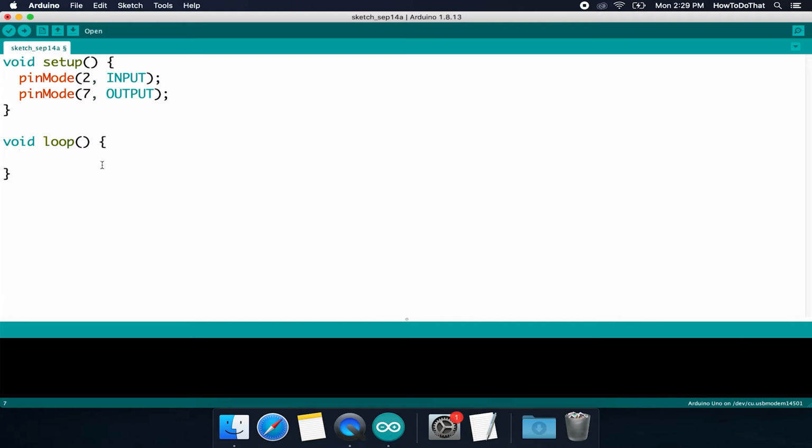Now, to start out writing a variable, you need to tell the machine what type of variable it is going to be. We've actually already said what type it's going to be. I said it's going to be either a 0 or a 1, which is an integer. An integer, int means integer. It just tells the Arduino this is going to be an integer that's stored in this variable.